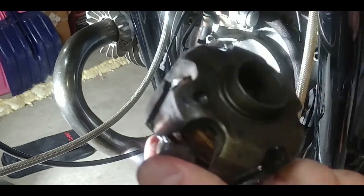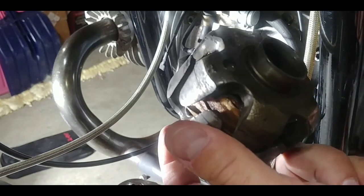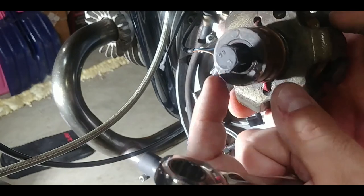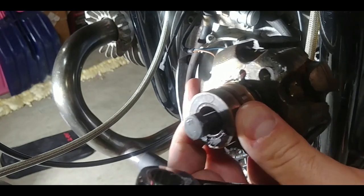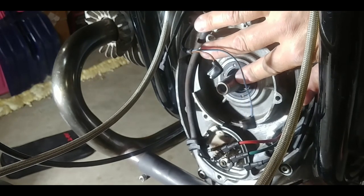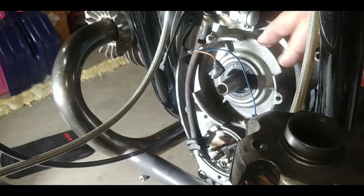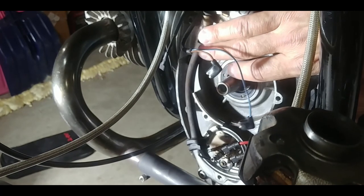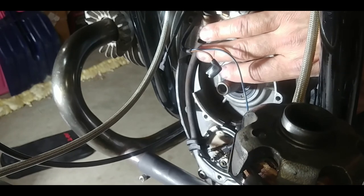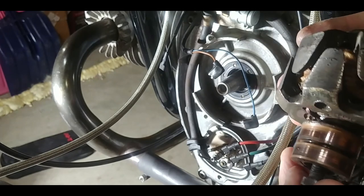The connection is done by means of a taper — so it's a taper fit. There is no key in there. So a female taper and a male taper are machined so precisely that they slide right into each other and then almost fuse together. The bolt that goes into the end of the rotor here really only applies a little bit of pressure. You got to make sure that both surfaces are completely grease-free and clean — also no burrs, no scratches. If there is maybe a scratch on the end of your crankshaft, you can polish that out a little bit, but I would be really careful, using maybe 2,000 or 3,000 grit sandpaper or some emery cloth.